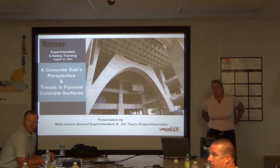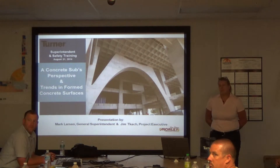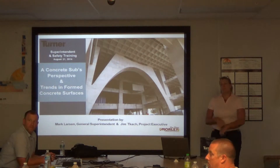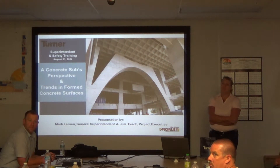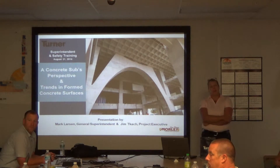How long you leave things in place. Delay strips — taking care of those later when you want to be building on the floors, but now you've got a two-foot gap on the floor and you can't get there. Post-tension versus regular mild steel concrete all have different aspects, advantages, and disadvantages about how you want to put your schedule together. So it's imperative to get with these guys early on and devise a plan in the pre-construction process so that execution is a lot easier. Because reacting and being firefighters in the field is not what we want to be.